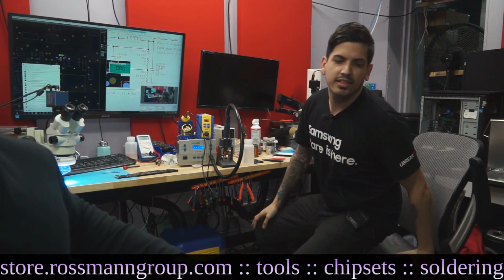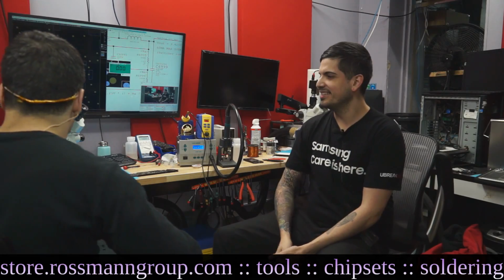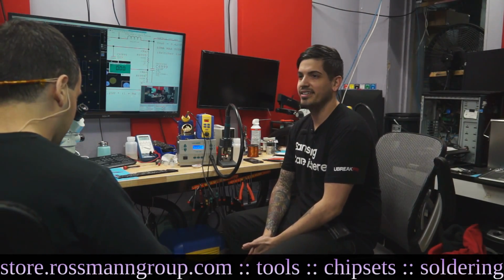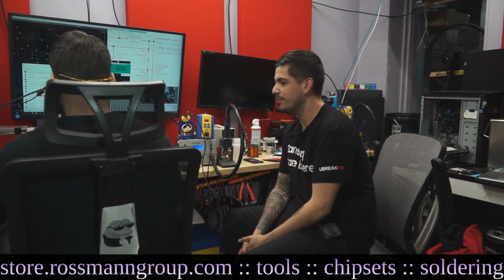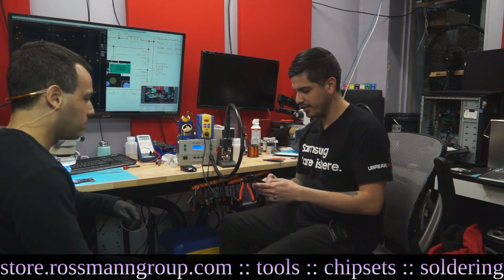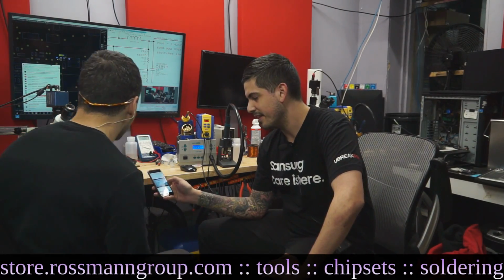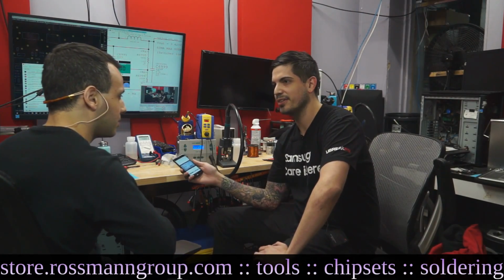Slippy? That should work. All right, so who are you? I am Ross from UBREAKIFIX. Nice to meet you. So what do we have here? I had a customer accurately say their LED driver or backlight driver burnt out and they had no backlight. I took it in just to diag it. I opened it up and took a picture because I didn't have the video feed. Surprisingly, they were very accurate. That's very rare. And that is actually the only area on the entire motherboard that has corrosion on it. There were no other signs of liquid damage.